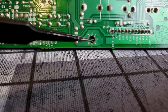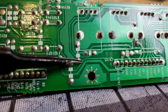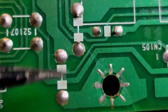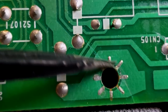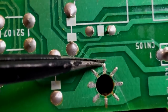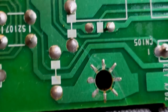I also need to check out down here next to this point where it was screwed in opposite of this side, because it looks like there might be a break right here causing both this line and this line to be interrupted. Now down here, this is all just extra grounding, so you could still get some grounding from this portion, so that's not as big of an issue as these two lines may be, and also we may have a problem right in here eventually.